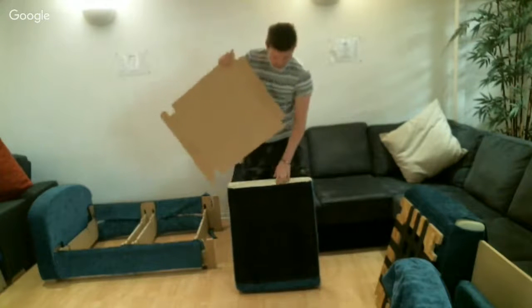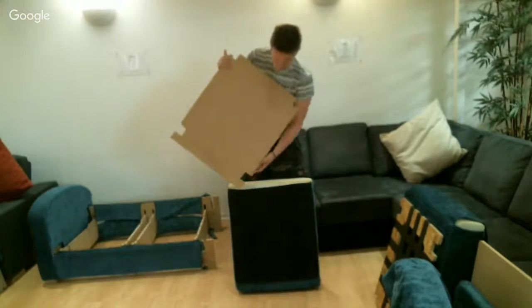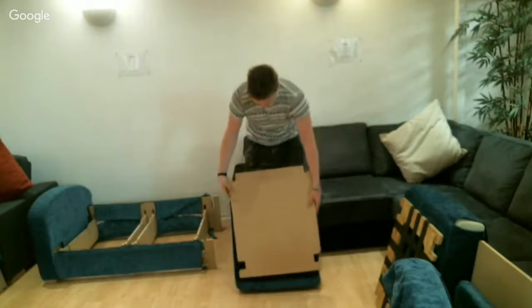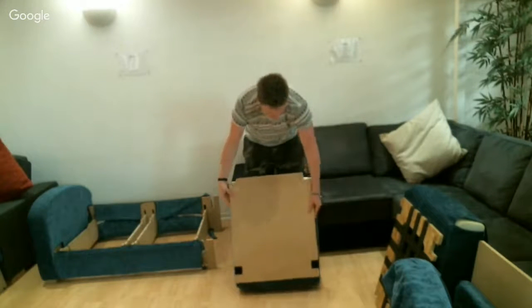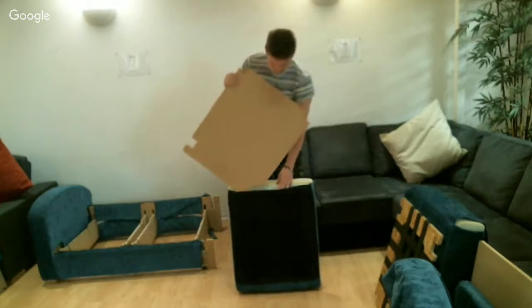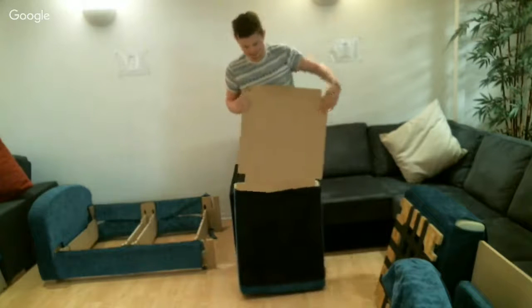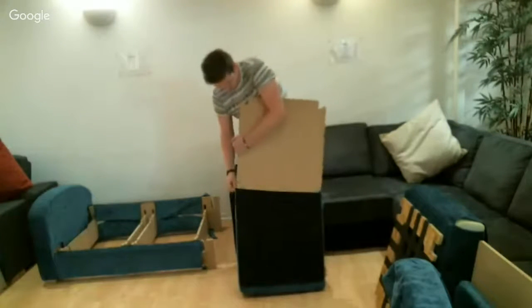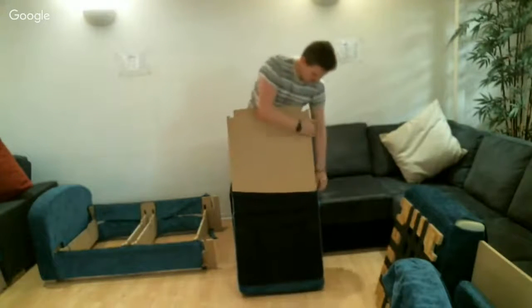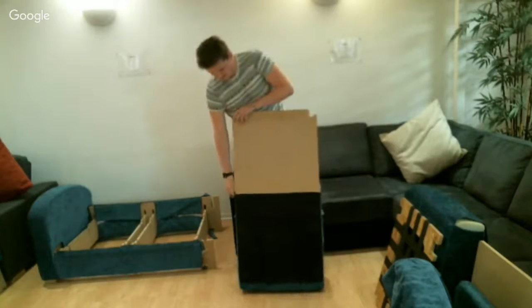So you put in the large cutout, goes in first. So the board's going to be positioning in like so. And the technique we use is you put it in a little bit like that and just give it a gentle swing. So it gets right into the corner, and then use this hand to overlock it inside. So you've got both in like so. Now what you do is push down bit by bit.